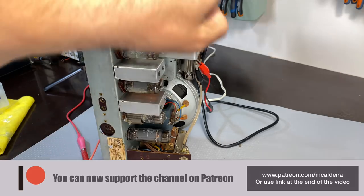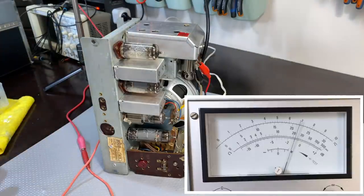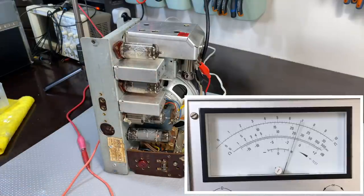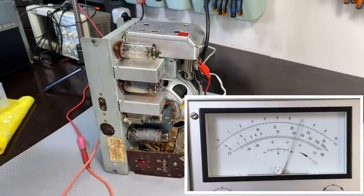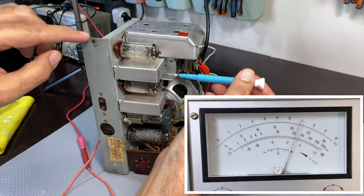is I've put the modulation on in the signal generator so we can hear it. We're basically hearing a 600 hertz tone FM modulated coming through at the carrier frequency. Now, what I need to do is turn off the modulation. I had to increase the signal generator amplitude to about 2 millivolts, and that gives us about, what is that? That's on 1 volt, so about 0.7 volts RMS, 0.7 volts DC, and it's negative DC because this is a negative voltage. Now I'm going to start with these guys and see how we get along.